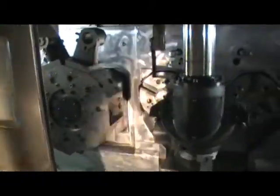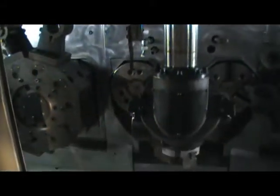Coolant pumps, separate for the right hand side, start and stop buttons with emergency. So you can run the right side separate. And the left side you can run separate also. That's a start on the left side control box. At the moment, if you want to use the gantry loader, you can set up your part and run your parts, changing it manually. So it's not a big issue.